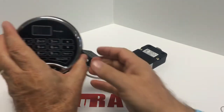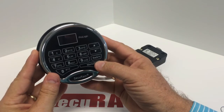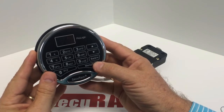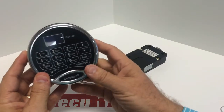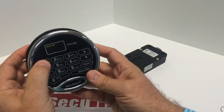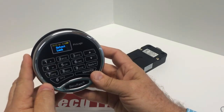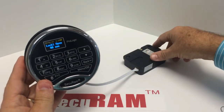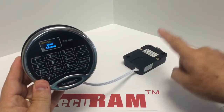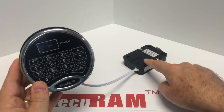In order to name this lock, enter your code and the system will ask which lock you want to open. Select lock number one since that's the only lock connected, and it will name this lock as lock number one. Enter the super code — it will say Verify, then Select Lock. Select one, and it will send a signal so this lock opens. This lock is now named in the system memory as lock number one.